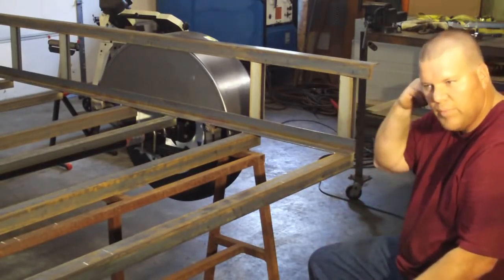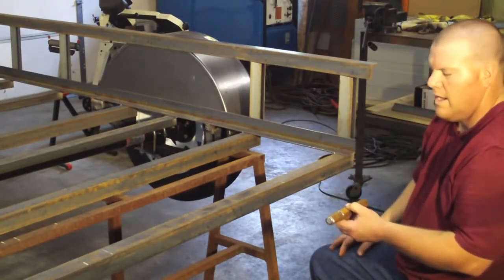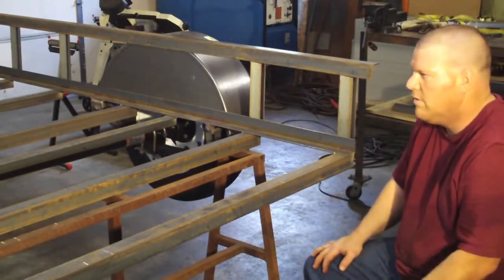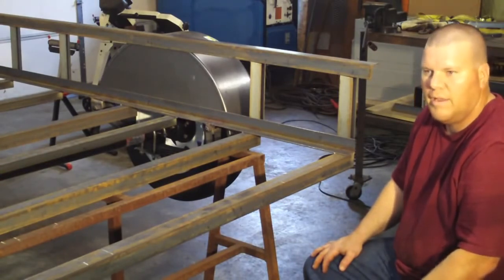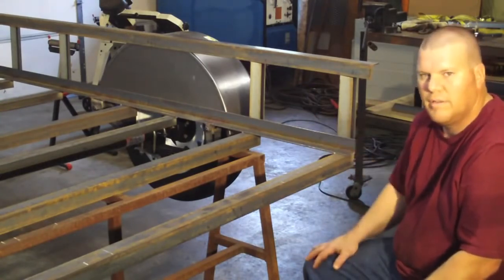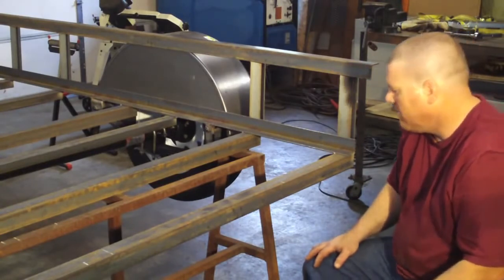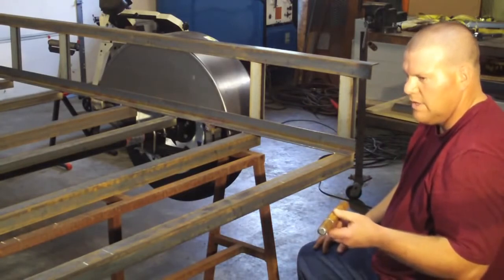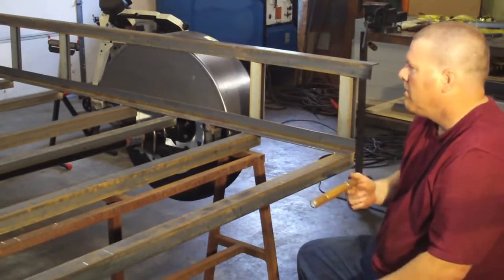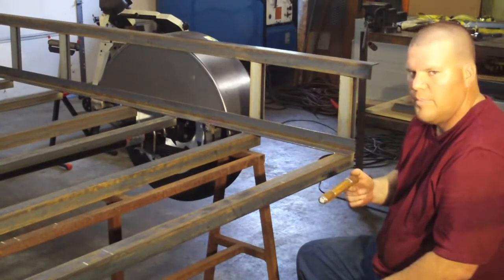Now, I've had plans in the past where I've done this with 4, 4, and 4, and I've run the rod all the way across, so you have like a 5-foot long piece of 3/4 inch rod. Well, money is money, and everything is getting more expensive these days. And you're not hauling a skid steer on a trailer like this. I have a tendency to overkill everything, but I'm getting better. So I really toned down the hinges, and believe me, this is still plenty strong enough. Someone would look at this and say 3/4, are you kidding? But whatever, it's not much. This versus a 1/2-inch setup, what are you talking, a couple bucks?